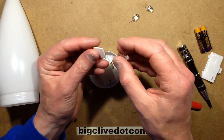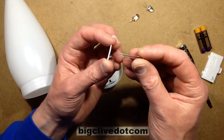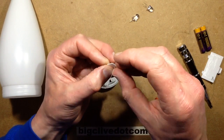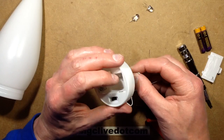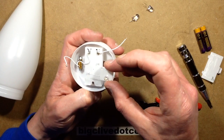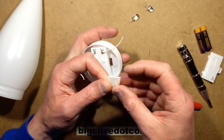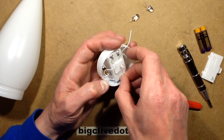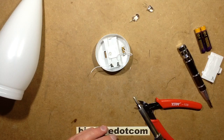The temptation is to actually drill two more holes to allow me to put the LED dead center, but I've already tried it and it doesn't seem to matter too much where it's put. So all I'm going to do is thread this LED through any of those two holes and bend the leads back because that's what holds it in place. I might as well clip it back in place now. This terminal is coming off the negative battery terminal - I can tell because it's got the spring in it - so this is going to be the negative wire. I could actually put that lead straight over onto the battery terminal and do that - that saves even having that wire.